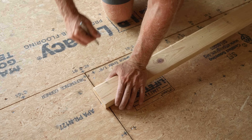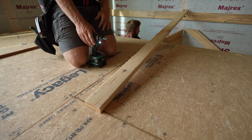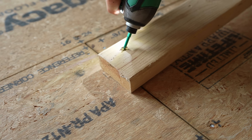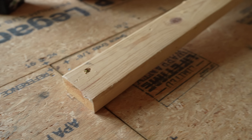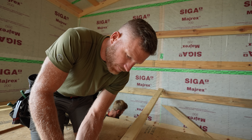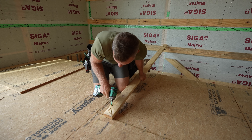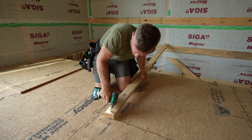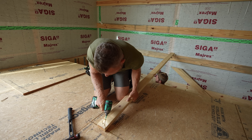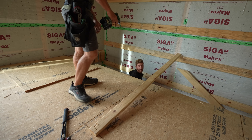We want to get roughly five-eighths of an inch of movement. I'll pull that board out — that did move some of it. I'm going to get a screw going at an angle. We got at least half of it. If we're off an eighth of an inch there it doesn't even look like it, maybe three-sixteenths at the most. I'm okay with that. We went over half — that's good for me.